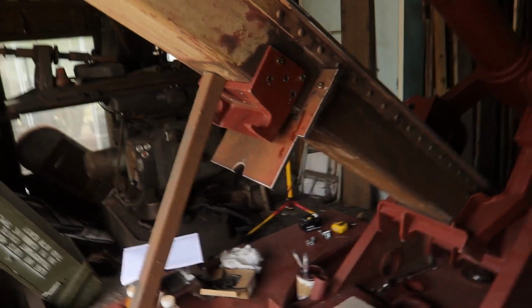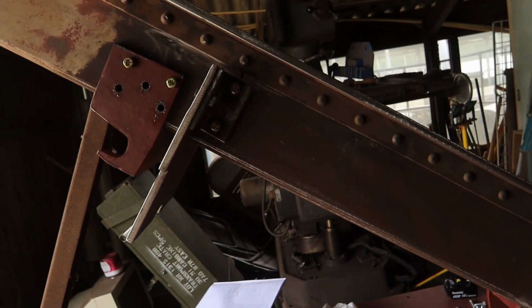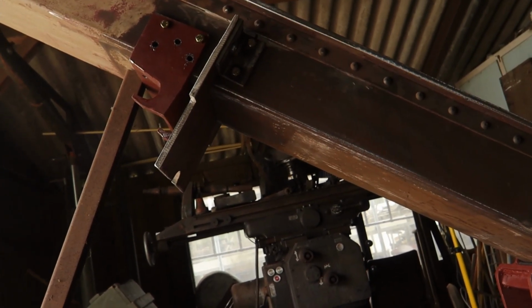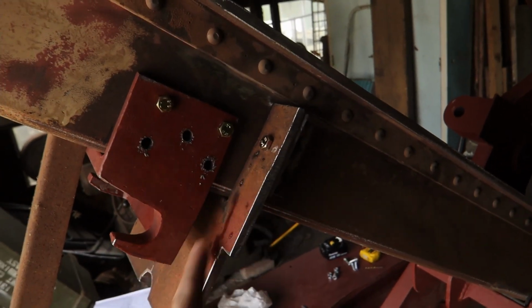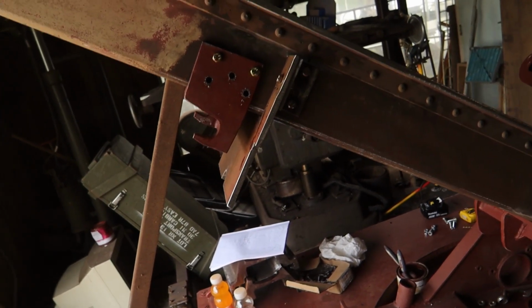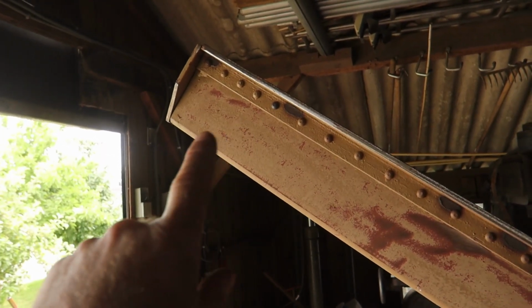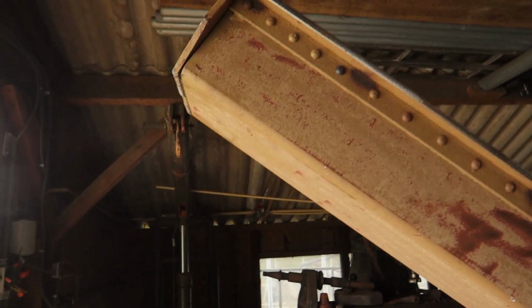This plate, when we were measuring yesterday, it has a bracket here that's riveted like an angle iron, nothing underneath, so we missed that. There should be a plate there as well, so we're gonna make that. But the strange thing is, this one has a hexagonal bolt, and the ones in there, they have countersunk bolts. So that's a bit odd, but yeah, it is what it is. And then I need a bracket with 3 holes in a triangular pattern over there, and a few extra rivets there, as well as at the bottom in front.